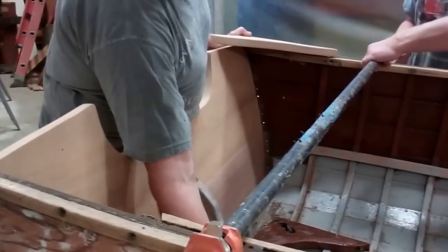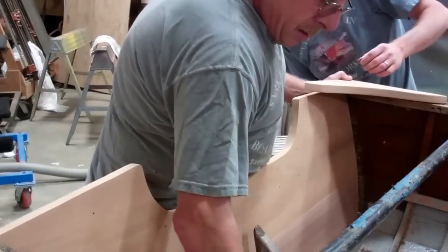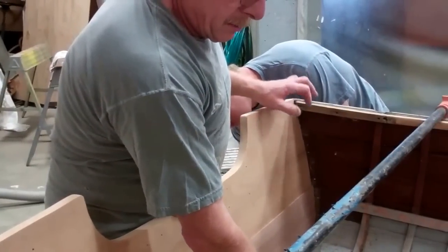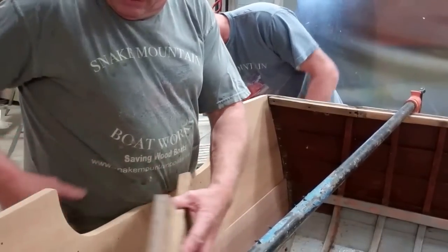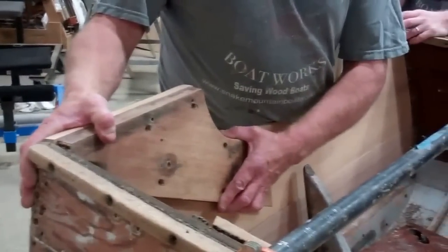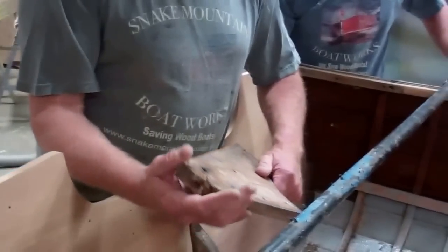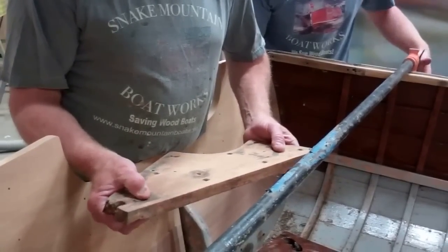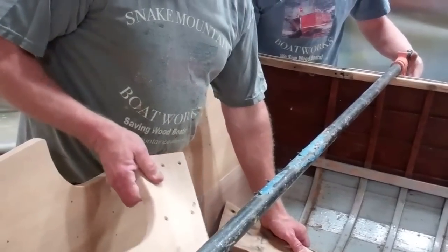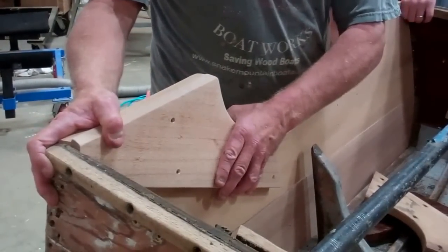I fixed a little bit of stuff right here and have that drying. The inside piece — I'm just going to pull them in place right here. These pieces go in here as reinforcing and they double up the screws on the outside of the transom. But this is all dry rotted on the end here, all shot. So I made up a new piece that's good and solid. We'll add reinforcement to the bolt that way.